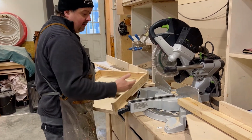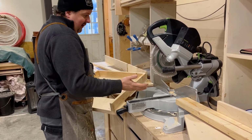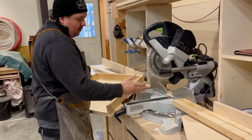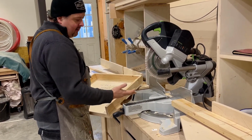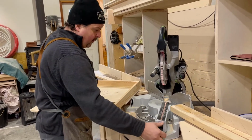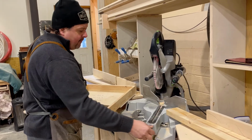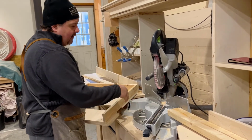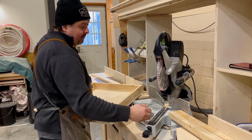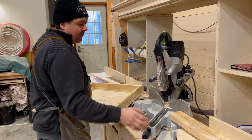On the Mitre saws I've used, the dozen or two Mitre saws I've used, I don't know how many, all have it at 0 when it's at 90 degrees to the fence. And so when I move over to 45, sorry, I had it partially locked there, that's 45 degrees off 90 from the fence, but it also conveniently is 45 degrees off the fence.